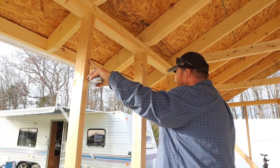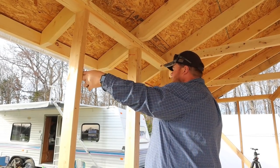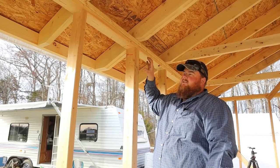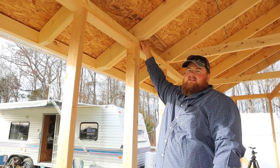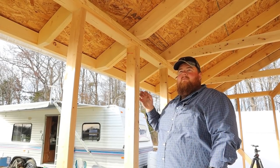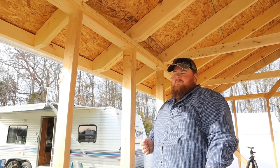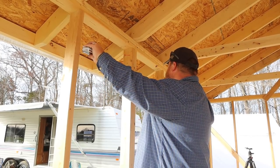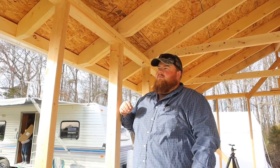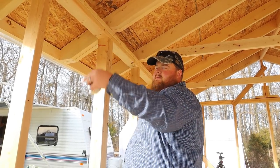I've got my king studs marked — those are the original wall studs. I'm going to add a jack stud on each side to support a header, then cut out the studs in between. I'm not really concerned about the roof sagging when I cut them out because my double top plate spans that area with no joints, and this is a very lightweight roof with only OSB on top so far. My beam width is 46 and three-quarter inches. I'll make that out of two 2x6s with half-inch plywood sandwiched in between to give a full-thickness beam that disperses weight down through the jack studs to the floor.